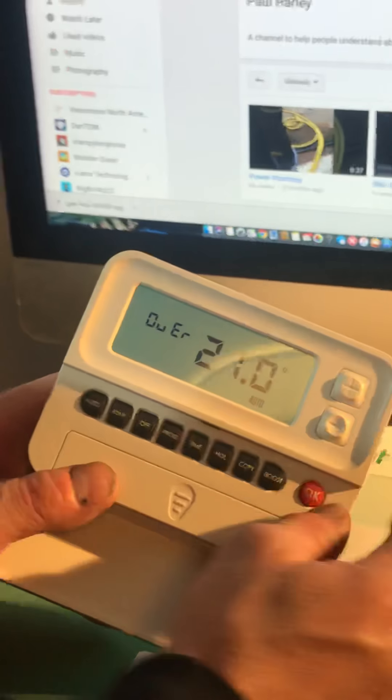I can manually operate the heating system, but when I do that it is exactly what it says — you are manually taking over control of the clock. If I press Manual I can bring the temperature to what I want, say 24 degrees, and press OK. The programs no longer take effect; we are manually operating the clock. It will keep to that temperature until you make a change. That's something you wouldn't use often, but it might be used more for heating systems running 24 hours a day.